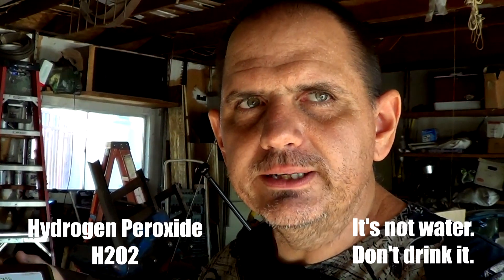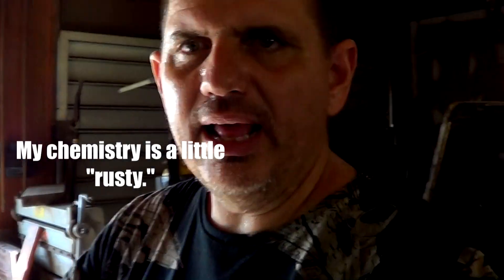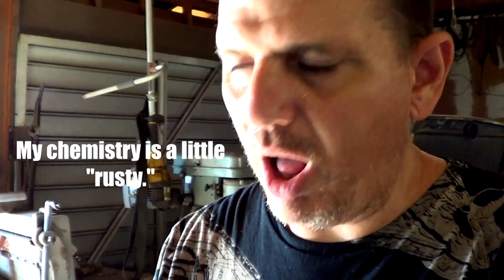I'm not entirely certain what the vinegar and the salt do, but I have my suspicions. Think of hydrogen peroxide as super-oxygenated water — it's very similar to water in its chemical makeup except it's literally got an extra oxygen molecule. That's what rust is: it's an oxide of iron. When we spray this on the metal, that extra oxygen molecule bonds readily with both the carbon and the iron in the steel. When it bonds with the carbon it releases carbon dioxide or carbon monoxide, and when it bonds with the iron it leaves an oxide of iron.